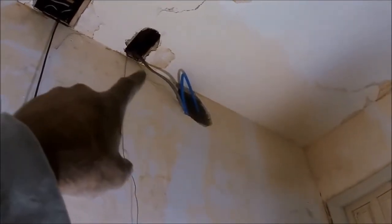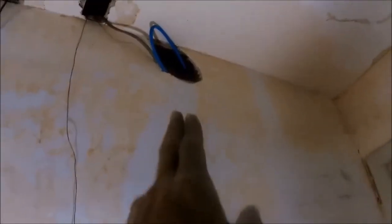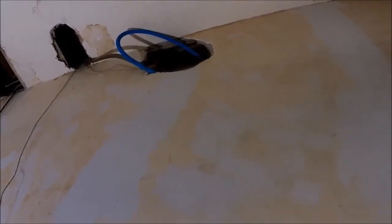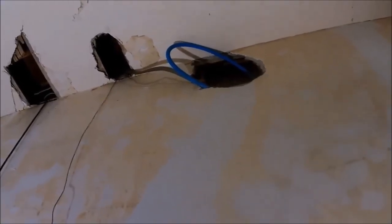There's another cable coming from the basement all the way up, and it's really stupid the way they ran it — they ran it in one wall cavity and then crossed over and went into another cavity, so I might have to break all this lath and plaster here to get that tucked in and then patch it. Quick note for the future: the heater upstairs in the attic runs a gas pipe right here in the wall, about eight feet away from this corner edge, and it runs right into the wall here and goes all the way up to the attic. If it ever needs repair, that pipe is right there. There's also an electrical line that goes up to the second breaker from the basement.